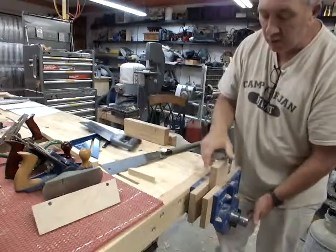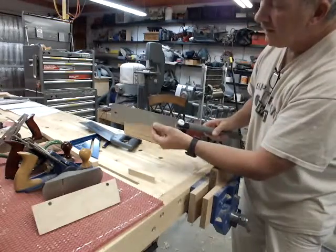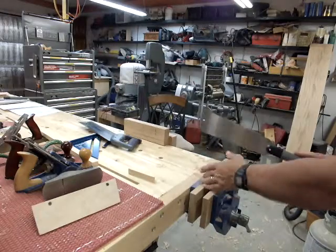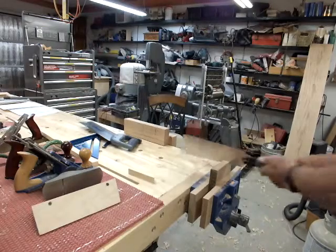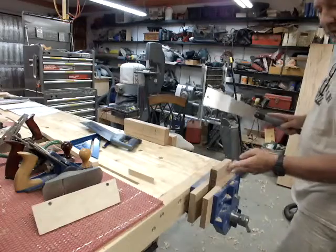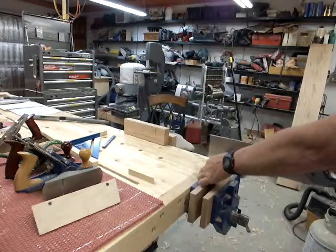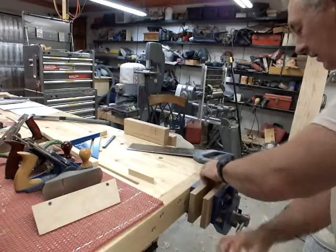Now let's try a cross cut, because we have a two-sided saw here, so we have dedicated cross-cut teeth. We know they're going to cut good. I'll go down about 3/4 of an inch. 1, 2, 3, 4, 5. That gives me about 3/4 of an inch, a little bit of tear out on my side, perfectly clean on this side. Let's try this one. Starter cut. Oh, my piece is wanting to crack. I'll lower it a little bit.